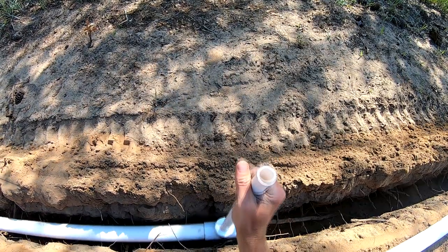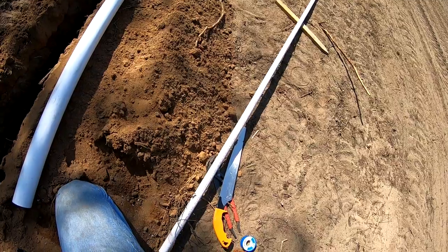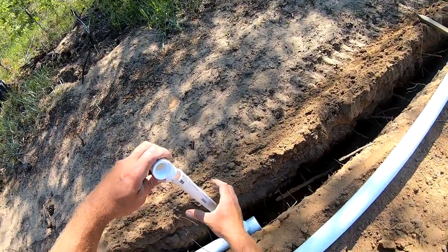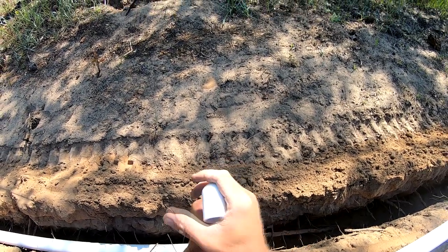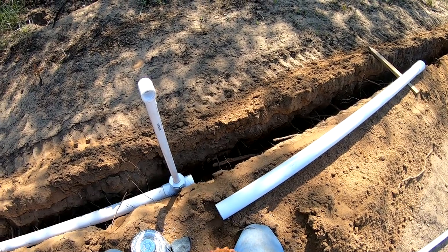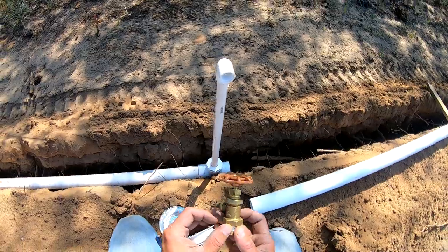We have a little play here with left and right, forward and backward, in case we want to straighten it up. I'll go ahead and install this first, then get a little gob of glue up in there. I like to just glue it — what's extra will squirt out. Make sure it's on there real good. You don't have long because this glue melts the plastic together; you only have a couple seconds once you attach those. Now throw a little Teflon tape on here — screwing this way, so I need to come from this way.